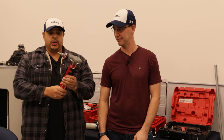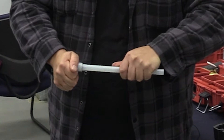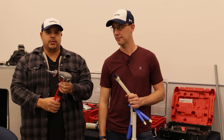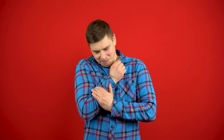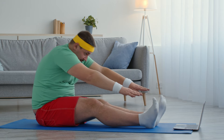Another reason why we're switching is you get to use a tool instead of having to crimp all the time. We switched a while ago from the big scissor crimpers — those were tough on your elbows, wrists, and sometimes your shoulders in tight spots. This tool here, all you do is press a button and it expands the PEX with the ring, then you just slide it on the fitting. We moved on to mini crimpers, which was great for tight joist spaces, but over time your wrists, hands, and fingers just start hurting — it almost feels like arthritis. When you've done this as long as Karsten and I have, you're looking for ways to preserve your body's longevity.